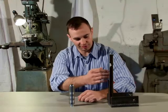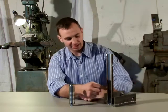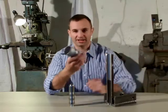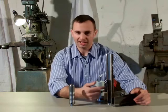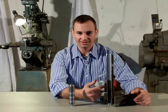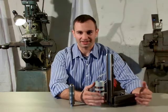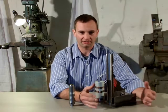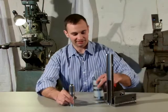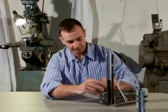On smaller or hobby style machines, you have a tube and plastic pellets that are lumped together in this cavity, and they're being heated by a heater like this. Well, this is actually a bigger heater. But the problem is that on the outer periphery your pellets melt fairly well, and in the middle the plastic doesn't conduct heat consistently as an insulator, so the middle stays colder while your outer edge gets overheated. And that is how Medium Machinery combated that problem with the introduction of this plasticizer.